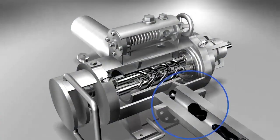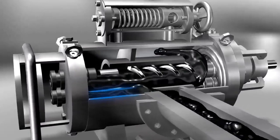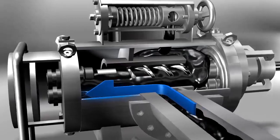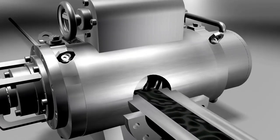The L2 pump will not suffer damage from cold slugs entering the inlet. Cold slugs enter the suction chamber and become elongated due to the internal flow path. The asphalt does not immediately enter the screw profiles; it is instead diverted to the end of the pump and then enters the screw profiles, where it moves from the suction chamber to the discharge chamber within the pump.